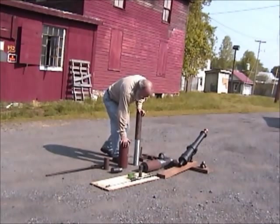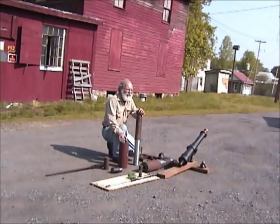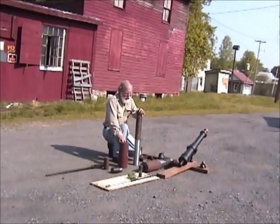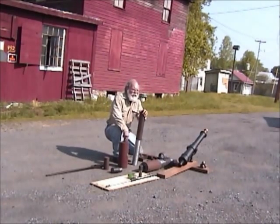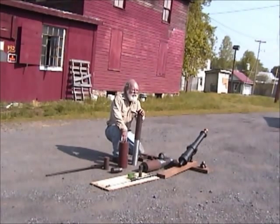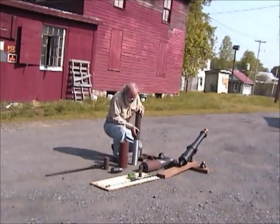This is a 14-inch long piece of 3¼-inch inside diameter, 5¼-inch outside diameter, seamless steel tubing. It actually has a nice, smooth, regular bore so we don't have to bore it out. And the bore on this is 3.245, so it's about six thousandths smaller than the turned section of the other tube.